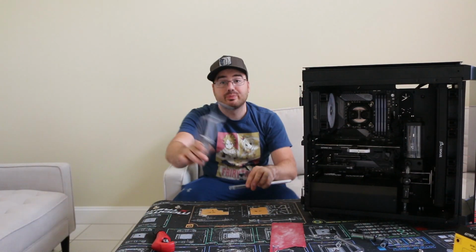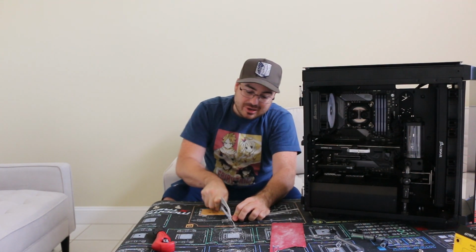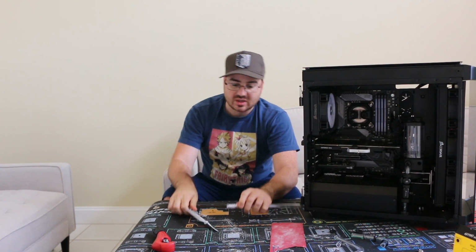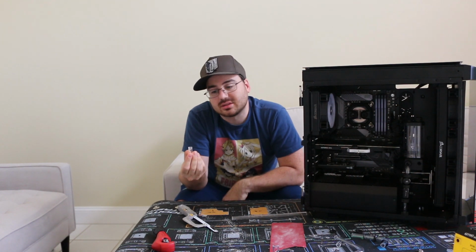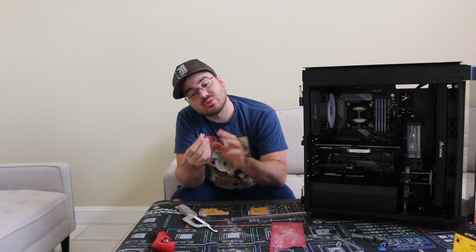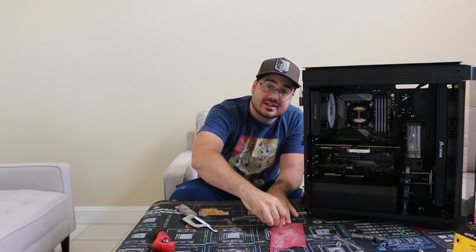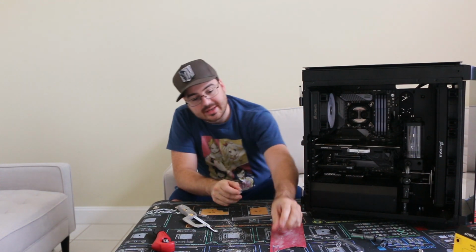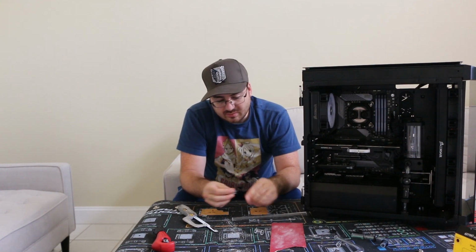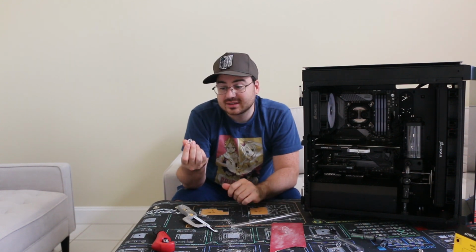What do you have to cut with? A hacksaw. So you just cut it. Now there's a few problems with cutting with a hacksaw. For one, it's gonna leave jagged edges, and usually it's not going to be perfectly even, so it's going to be a little slanted, so you're going to have to sand that down a lot more than you would when you're working with PETG. Also, the acrylic is nowhere near as durable as PETG is. You saw how easily that cracked?